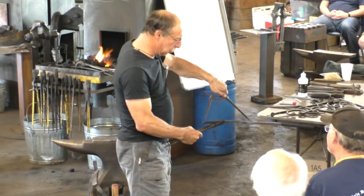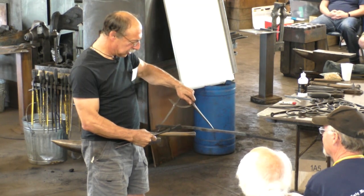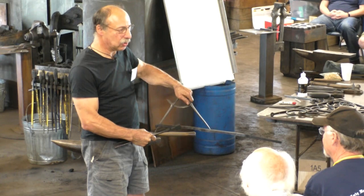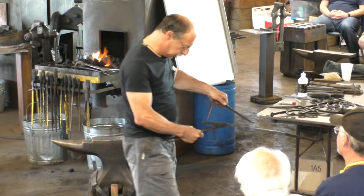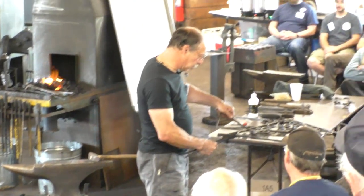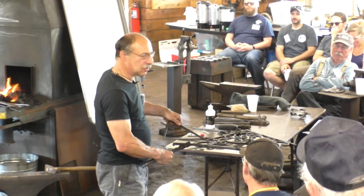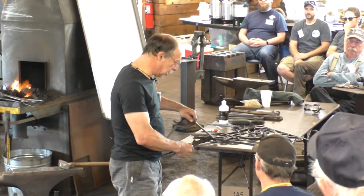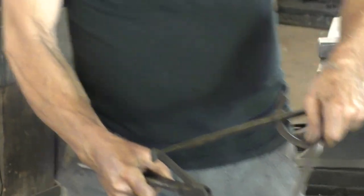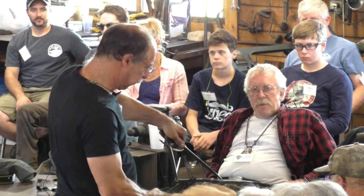Yeah. So often what happens if you get tentative, the weld goes out that far. So you take another heat and you weld up more until you get to that point. Or if the weld were at 11.5, then what do you do? Draw it out. Split it open? Yeah, draw out this part a little more. Easy, easy peasy. So if it's too short, it's easy to fix.